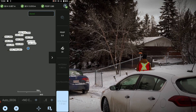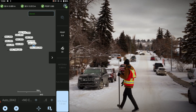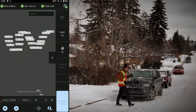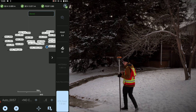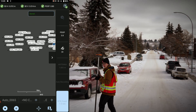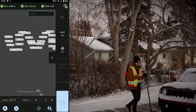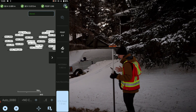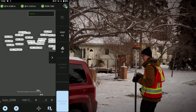This is really easy when using the auto record feature — I'm just walking back and forth and we're automatically picking up points every half meter, every 50 centimeters. This is going to allow me to generate a terrain model of my street that I can use to map drainage or whatever else I need. I can set intervals tighter or wider to get the resolution I need on my topo map. And because I have this tilt sensor, I don't have to worry about my pole being level at all — no matter how much I'm tilting it, the receiver is always going to be accurate.